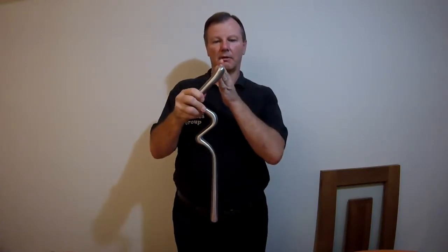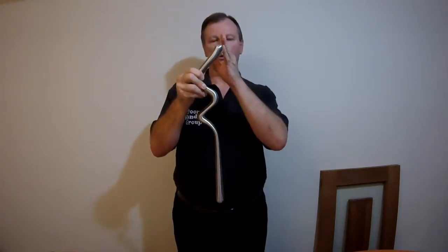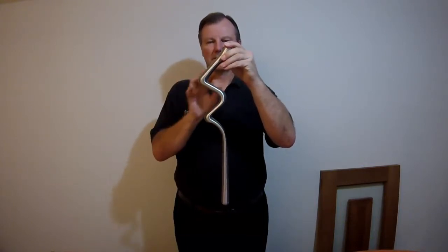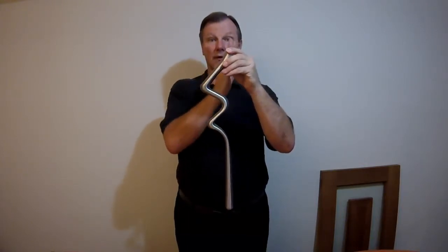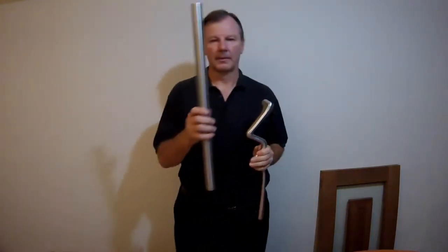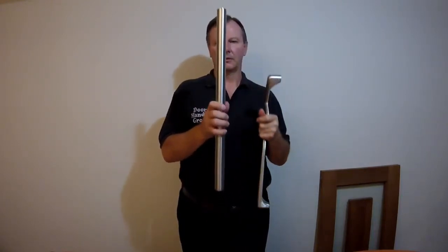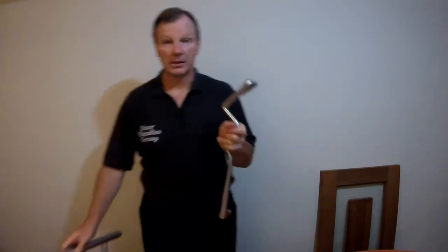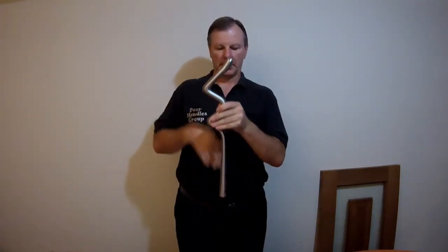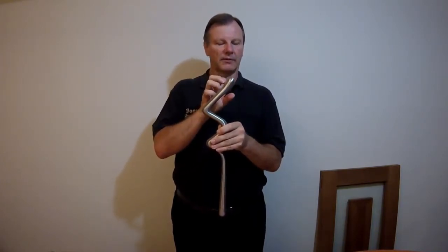So that means the point of fixing is here through this handle — this point on the bottom and the top — and you've got the side bits here. That means the majority of the handle is offset from the centre, whereas something like a traditional bar pull, the fixings are directly behind the major part of the handle, so that's in line. The offset handle puts a lot of stress on the connections into the door, which is why it's stronger to have a back-to-back or a remount fixing arrangement.